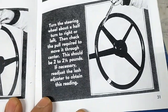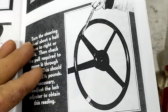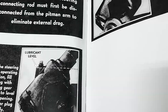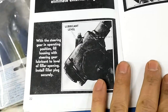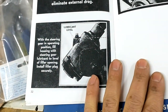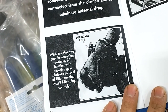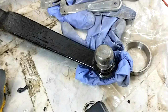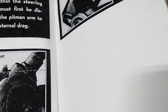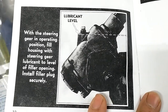It's a 70-year-old manual steering box so it's not going to be perfect, but it'll be a lot better than it was with fresh bearings and properly adjusted. You can adjust it while it's in the truck. You can leave the pitman arm on, but you do have to disconnect it from the drag link because it can't have any load on it when you're trying to set it.